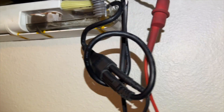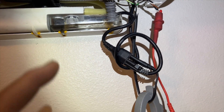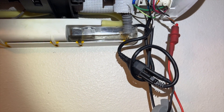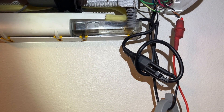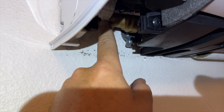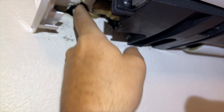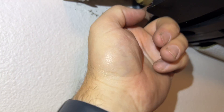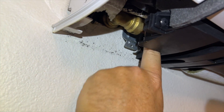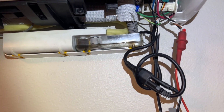There's something wrong with the pump. Thankfully I brought a spare. I'm going to take the pump out of the circuit and hook everything up direct to confirm the head works. I'll also verify it's actually cooling — I don't feel any oil, and usually there's oil on these, so this one might be okay. I'll verify operation first and go from there.